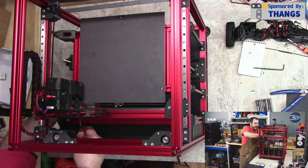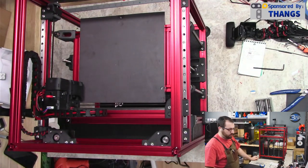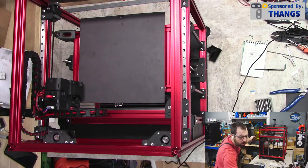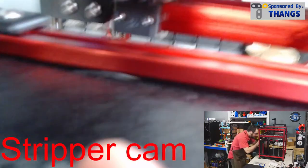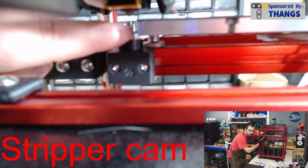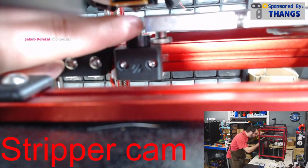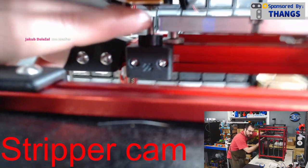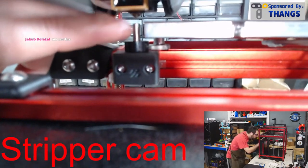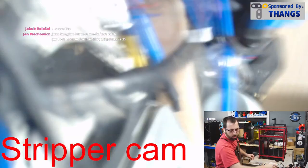Now you can move your bed back. And you basically want to air gap it. You can see it right there. See how we have an air gap right here? You want this air gap. So this pin is now right underneath your nozzle, and you want probably about 2 millimeters, honestly, the more the better, but you're going to lose print space, but you do want an air gap here, because you don't want the heat from the bed getting to the nozzle.